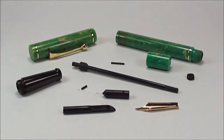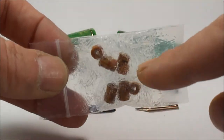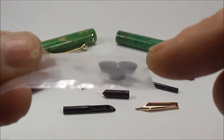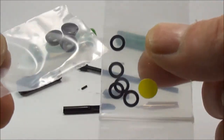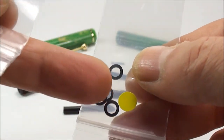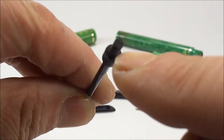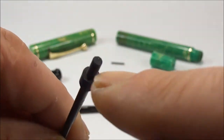Just here is a little pin that will hold this cone to the top of the plunger. Last but not least, we've got the cap, which has a beautiful gold-filled clip - we'll show you that in the second half. What I'm actually going to be doing is replacing the old cork washers - they've totally deteriorated. I've got these lovely new cork washers to be installed. On this particular pen we'll also be needing this back washer, and the rubber washer will sit inside the hard backing washer.